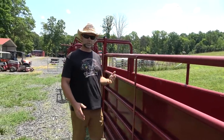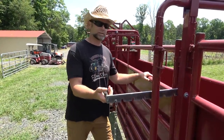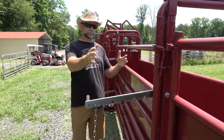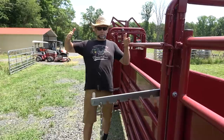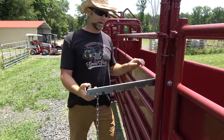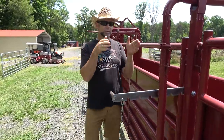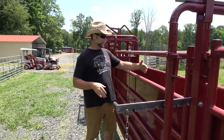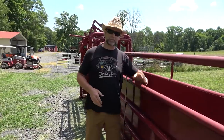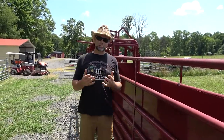And then we'll go to the next chute, which is adjustable. This is the adjustable portion of the squeeze chute. If you lift up on these handles right here, raise up, adjust the full squeeze. In other words, it will go down just like that. The way we're gonna do this is we're gonna put it on notch number 3 for our cows to slowly narrow down into this alleyway right here, and the cow will bump both sides of its belly on the inside of the alleyway. It's really, really cool. From there, we're gonna go right into the squeeze chute system.